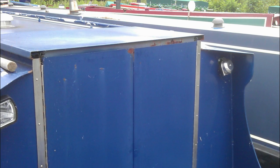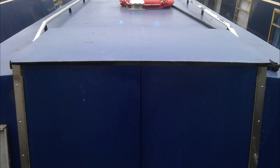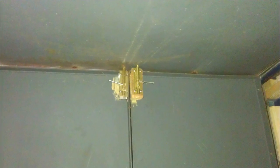The metal doors of the boat were a temporary addition for security while we built the boat. I had these fabricated at work and attached them to the boat with stainless steel piano hinge with nylock nuts to stop them undoing with the vibration of the boat. I also made two stainless steel sliding hatches and a stainless steel protective cover for the control panel on the left hand side. I experimented with several different locking options before settling on the slide bolts shown here, which were temporary but allowed us to lock and secure the boat.